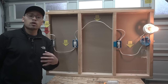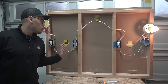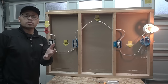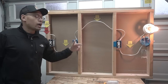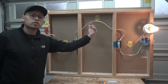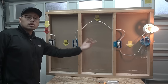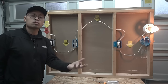You're probably asking, why do we even need a four-way switch? Well, it comes in very handy when you have one light fixture inside a room and you want to control it on three different entrances. Let's say one is from a garage entrance, one is coming from a bedroom, one is coming from a kitchen. You can turn on the light from the garage, then turn it off from the kitchen, and someone coming from the bedroom can turn it on as well. You can control the light switch on different entrances, which makes it convenient so you don't have to walk all the way across the room to turn off the switch. You can also add more switches along the way — you're not limited to just three switches. You can add more four-way switches between the three-way switches on each end.